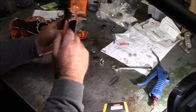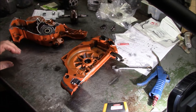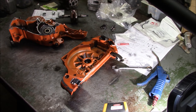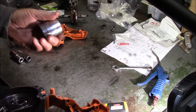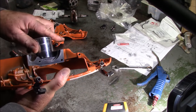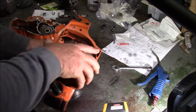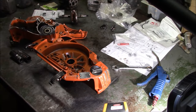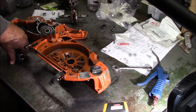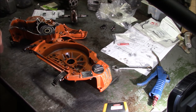I don't really have a slick way of popping those bearings out other than using the tried and true redneck techniques I've used on other saws before. Interestingly enough, this socket right here is an inch and a half — it just sets right nicely in that groove. It's almost like it was designed for that. I think I'm just going to tap it out. Heat the case up with the heat gun and see if I can't get it to tap right out of there.